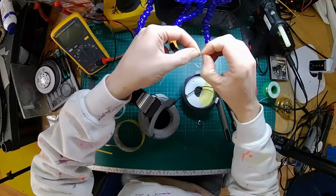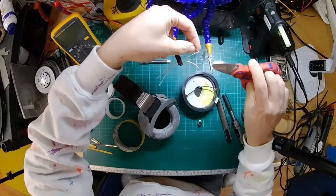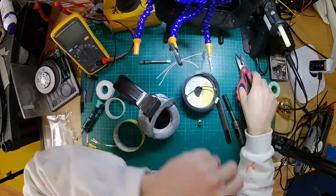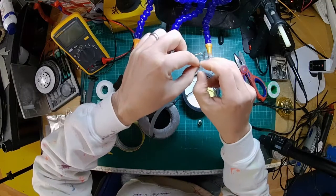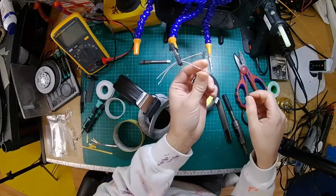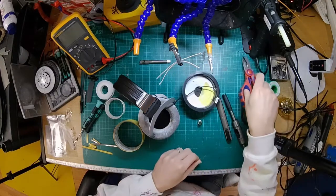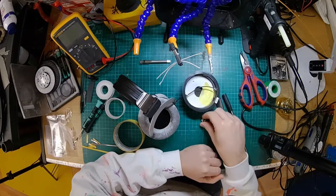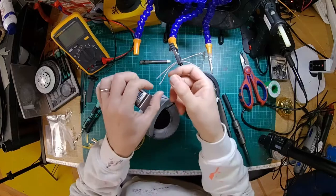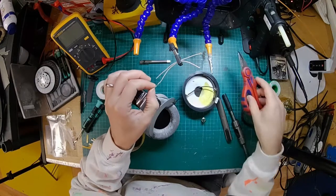Okay, I'm just going to remove a little bit of the silk. I'm using some of our litz here, you know, I'm sure if you were trying this at home, you'd use normal wire, so soldering this is going to be a bit easier for you. But yeah, I need to remove a little bit of the silk, tin it, and then I'm going to attach the two left wires to this, so pin 1 and pin 2. I'm going to attach wires to go to the driver. This bit's pretty lengthy and boring, so we'll probably just do a little speed up here or something.